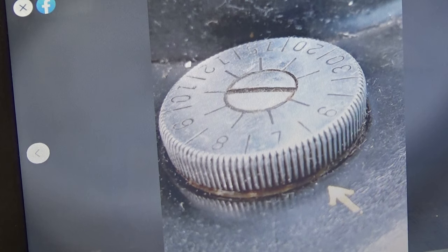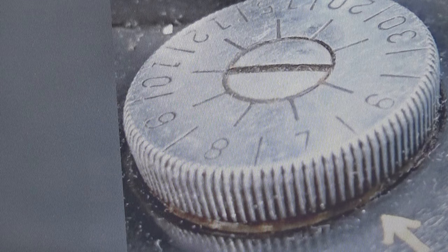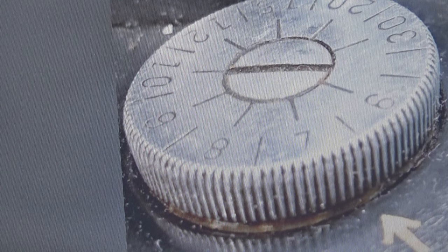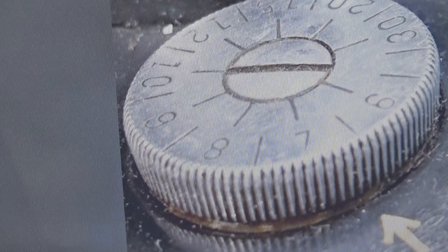And there's our stitch length, and not a major showstopper, nothing like, oh my gosh, look at the smoking gun. But if you look at the lower edge below where you would turn the dial, you can see all the junk on there, all the caramelized oil, the varnishing. And again, it just tells you a story of a machine that has not been maintained at a high level.